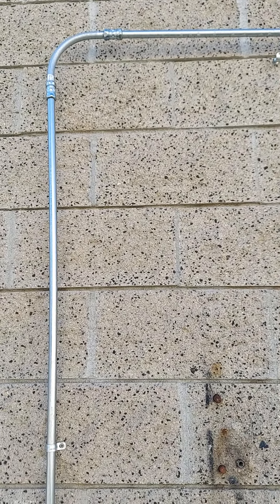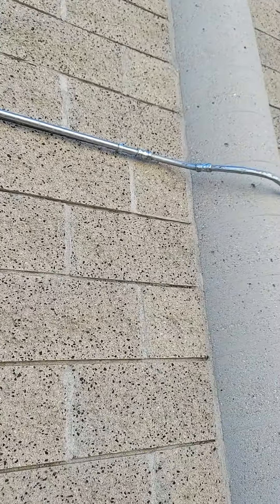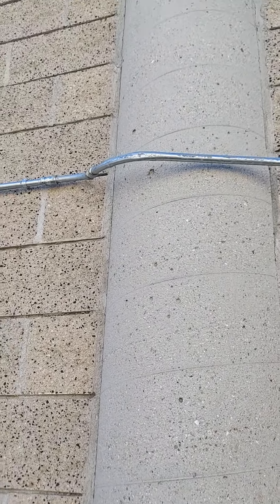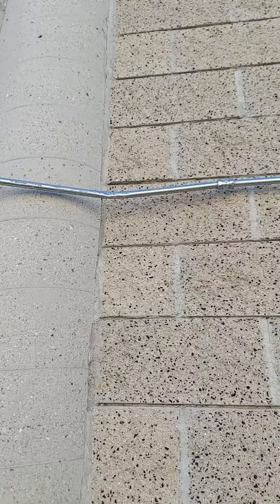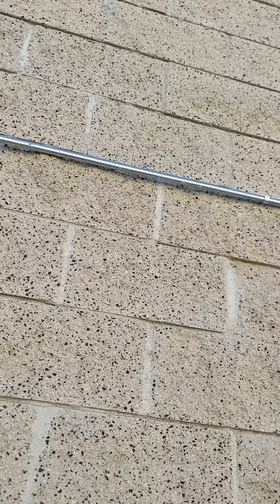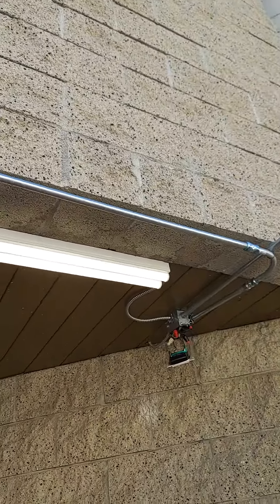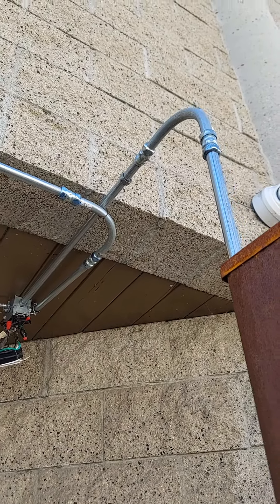There are one, two straps, nothing near the top of that 90 — it's supposed to legally have a strap within 12 inches. There's a strap right there but they bent it all the way back so it doesn't actually support the weight. There's another strap bent all the way back, which is illegal. Then there's a really shitty three-point saddle — they could have used a four-point and been done. No strap there, no strap here, and over in this area the strap is bent all the way up, which makes no sense. Then it goes to some tie wire. This shows these were residential electricians that did this.